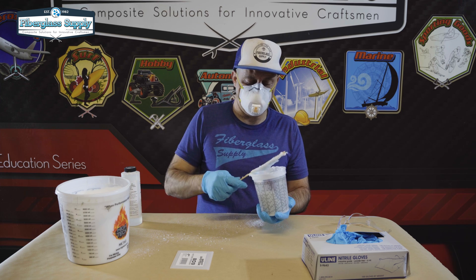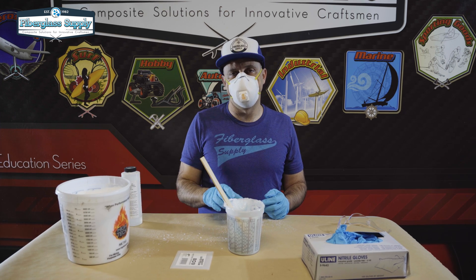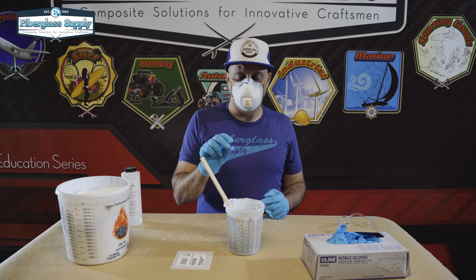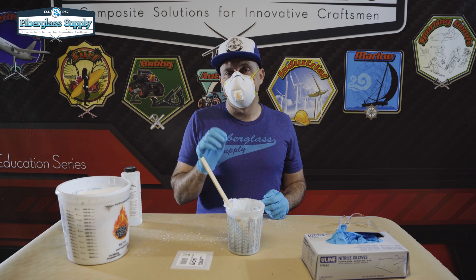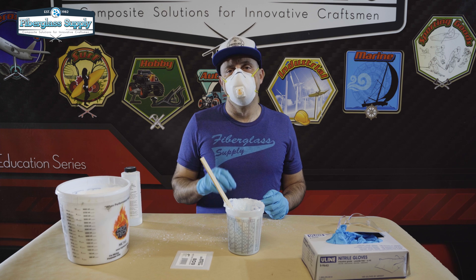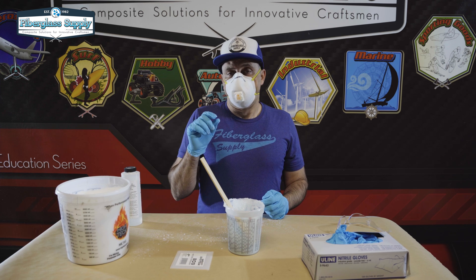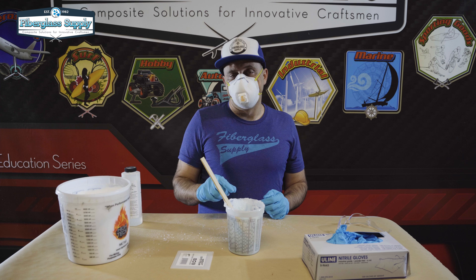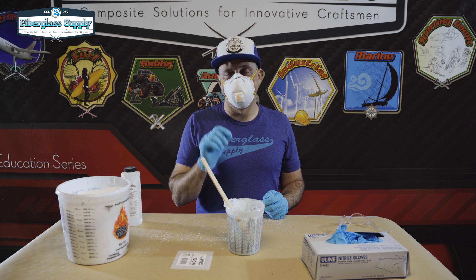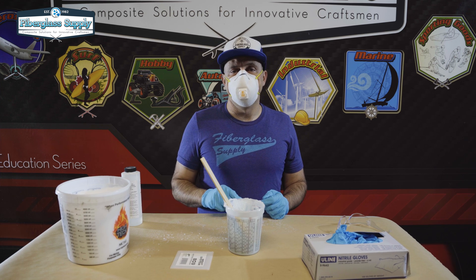So really simple: start with your epoxy, mix the epoxy first so you know you've got a good blend between your A-side and B-side, then add cabosil a little bit at a time until you reach the desired thickness. For some gluing applications you may want it slightly runny; for others where you've got big fillets or big areas to fill you'll want to go thicker. If time is not on your side or you're doing larger batches, you definitely want to go with the slow hardener to slow things down, because it will take a certain amount of time to mix the putty and get it onto the project. Thanks for watching this video and we'll see you soon.